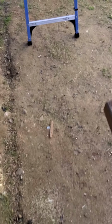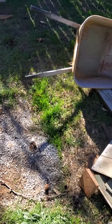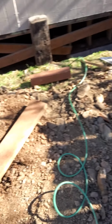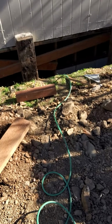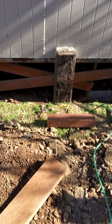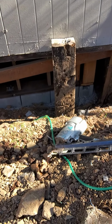Okay, so this is the video portion of the home inspection. First, I'm going to start with the garage. They obviously are reinforcing the structural support of the garage. I guess you can see how it fell and rotted on the railroad ties. They actually reinforced it with a new cripple wall and new footings on the inside.